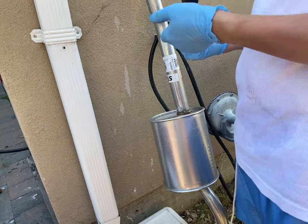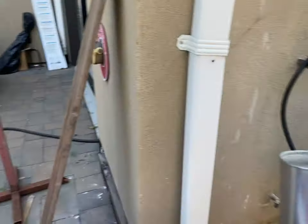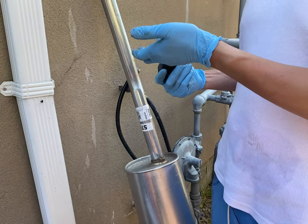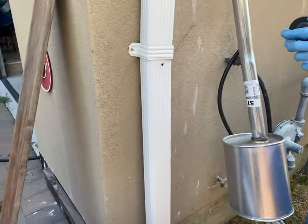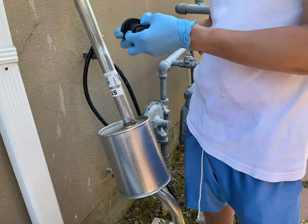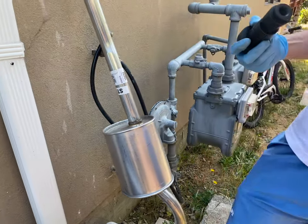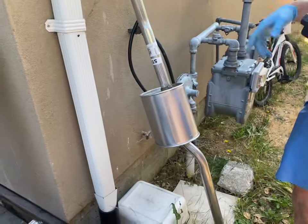It's not just for automotive — it says exhaust but it'll expand any copper pipe too. For grease, whatever you have is probably fine, but when the grease heats up you're going to see smoke when you turn the exhaust on. Grease this part because there's a lot of pressure. After you grease it you have to clean the grease off before welding. Just wipe it down — there'll still be residual, but the welding heat will probably burn it off in the welded area.